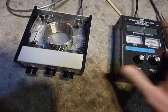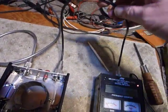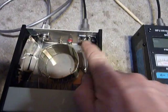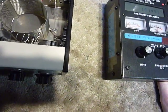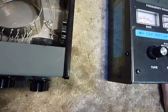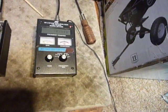One thing I noticed: I was using this on a small portable antenna trying to tune up on 17 meters and it would not tune no matter what I did. I thought I had a bad coax cable — this one right here, exactly 24 inches long. What I ran into was I needed a little more capacitance from the input of the tuner to ground. I discovered this by switching cables — I put on a 10-foot cable and the thing worked great. But I checked the original cable and found nothing wrong with it. The only difference was that the short two-foot cable had a capacitance of 76 picofarads, which I measured with my capacitance meter.